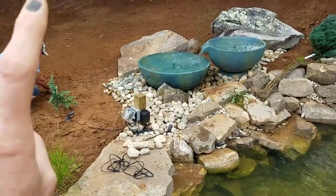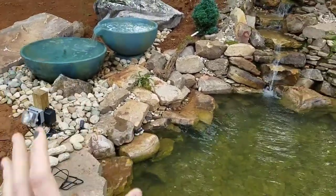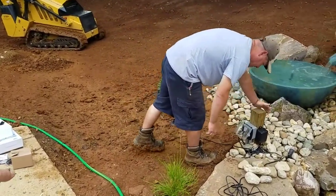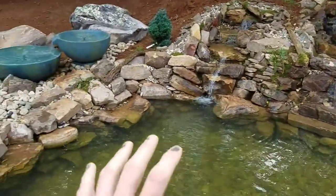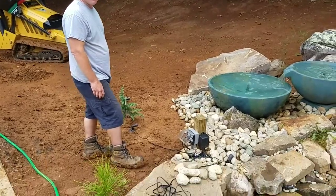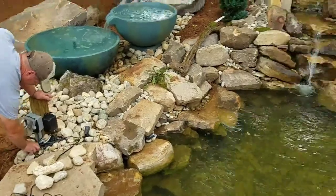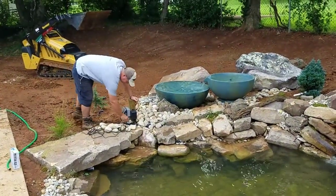These lights have to all be connected into one of our photo cell units. That photo cell unit, made here at Aquascape, is what tells these lights to come on and off during nighttime and daytime hours. This package comes with a photo cell — but since we already have a photo cell in use from this project, we're not going to use the one that came with the kit. We're going to tie it into the open outlet ends we already have run for this project's lighting needs. Stay with us — he's getting ready to connect those lights to the photo cell unit now.